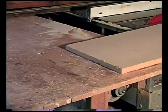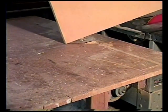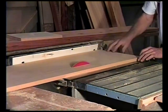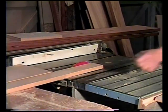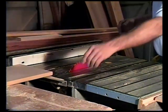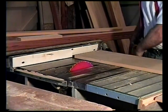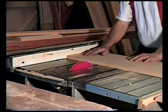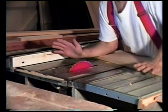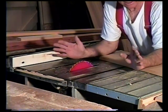The furniture building is perfect — you've got to allow yourself a little bit of room or it'll drive you crazy. Now we're at 10 and 5/16. I would suggest to anybody that's not real comfortable cross-cutting with a table saw to use a 12-inch or 10-inch slide compound miter saw. You really need one in your shop regardless of what else you do, especially if you're doing cabinets. You really need something to do cross cutting.